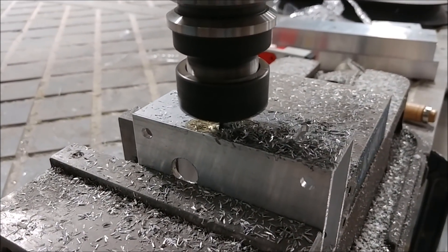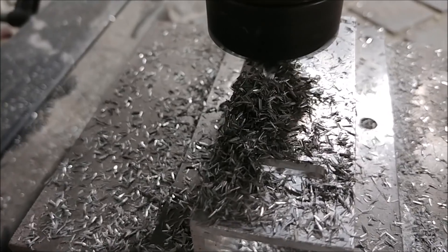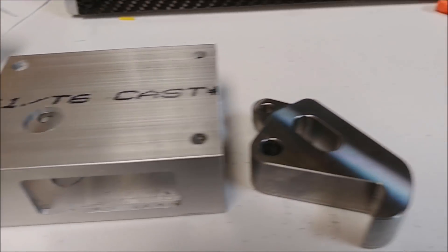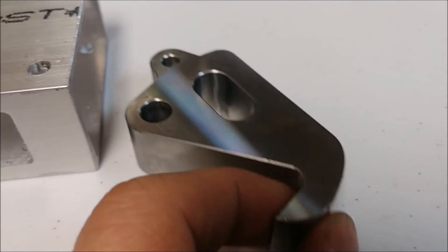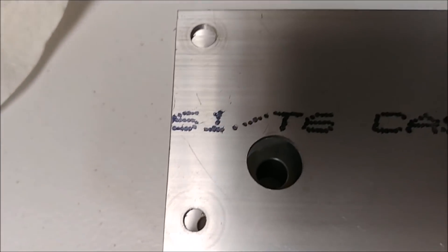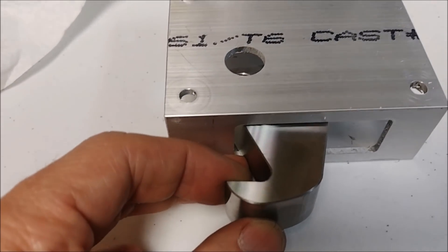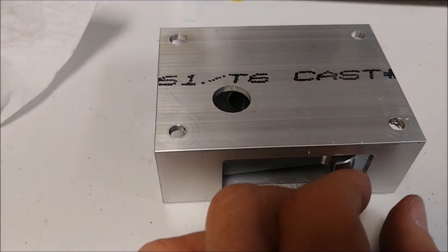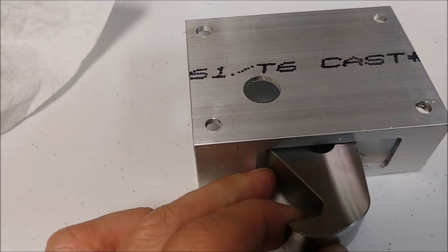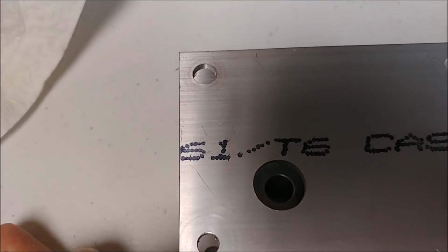I did the rough design and Mark did all the engineering design on them. I fired up the CNC, drilled the holes, and cut out the slots in these boxes. There's the finished product, and there's one of the hooks that we had machined quite a while back — glad they're sitting ready, one of the advantages of ordering ahead of time. There are some 4130 bearings or bushings that go in there, then a pin through there, and an over-center link that will be how the whole mechanism gets actuated. Once those are bolted into the doors, I'll be able to put the hard points for those receivers in the fuselage — one step closer to being ready to post-cure.